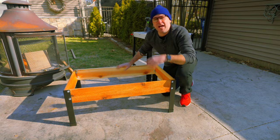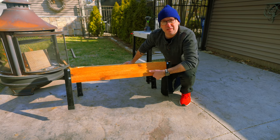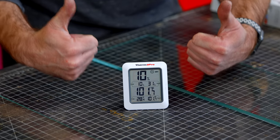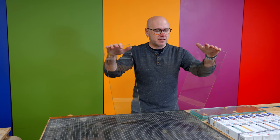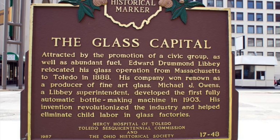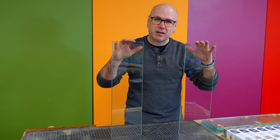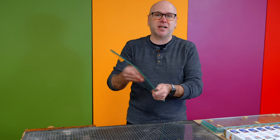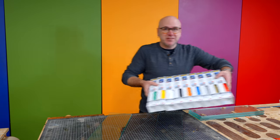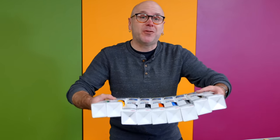So now we're going to go inside and make the glass top for this. This is the part I'm really excited about — it's really going to set off this table and add some color and character to it. We are back in the warm shop. This is the part where I get to colorize it using the Scotch Extreme Vinyl. I had a local glass company cut some — did you know that Toledo is the glass capital of the world? This is a quarter-inch thick and it is six by twenty. You can cut glass yourself, but I had them cut it so they could polish the edges. We are going to colorize this with some Scotch Extreme Vinyls. The cool thing is if I don't like it, I can just change it — and if you don't like the colors I choose, you can change it too.